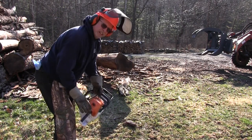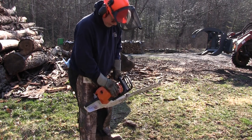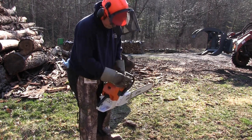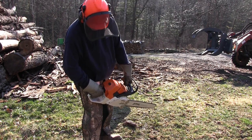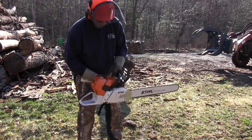All right, I'll start the MS-661. So hit the compression release, squeeze the trigger, put the choke on, and then crank it.